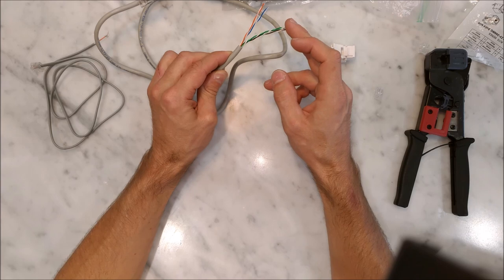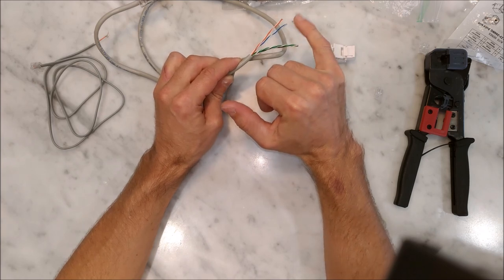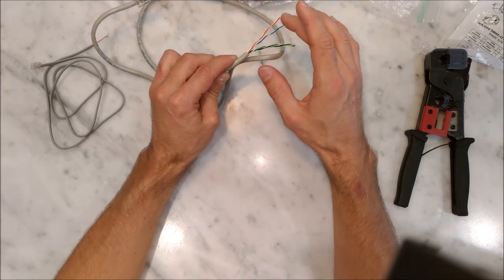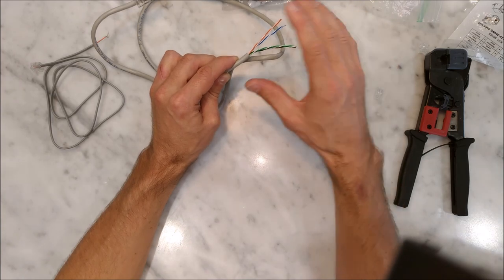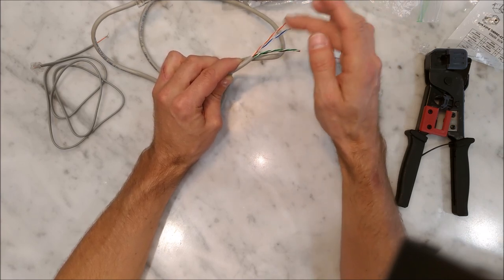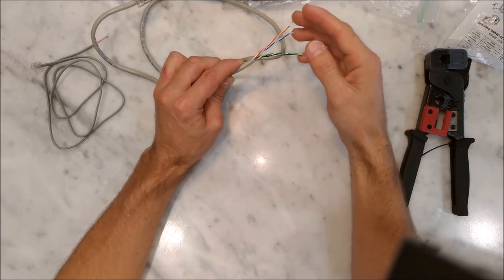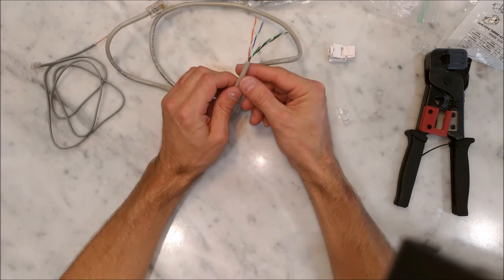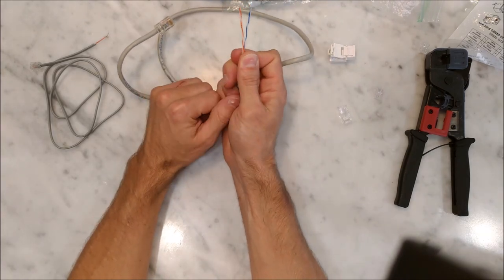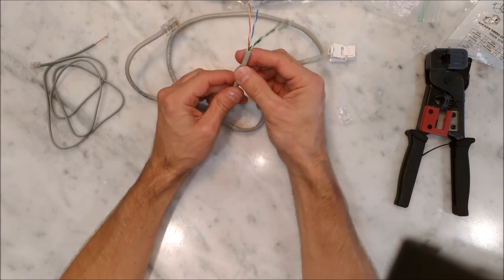This is twisted pair wiring. Do you see how the wires are twisted? Each bundle actually has a different twist pattern, and that twisting stops interference. By twisting them at a different rate, they don't interfere with each other — it creates a slightly different magnetic field around each set of wires. This is the wiring normally run through houses for telephone. It might be just two twisted pairs, like category 3 wire, or if you're really lucky, it could be four twisted pairs like category 5 wiring.